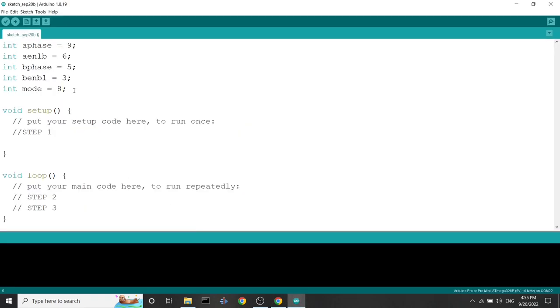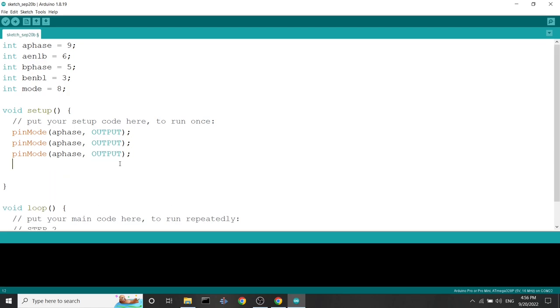We've got the motor driver connected to the Arduino by these pins. But the Arduino doesn't yet know what these pins do — we've just declared some numbers with their corresponding variable names. In the setup phase we declare what the pins should do using the pinMode function. Pin mode can be set to either input, meaning the Arduino expects to read a digital or analog value, or output, where the Arduino sends a digital or analog value. In this case we want our pins to be outputs.